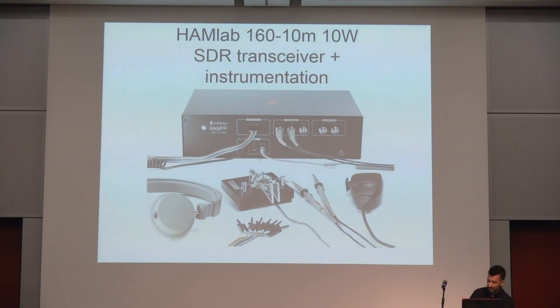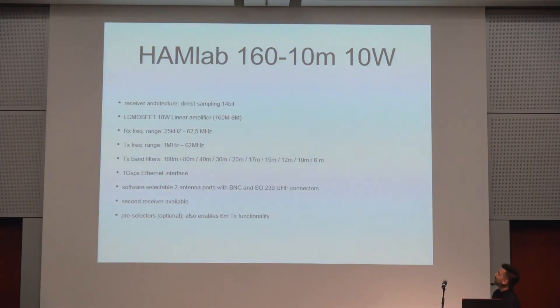Here's another picture of it. The frequency range covers all the supported bands. For six meters, the output of Red Pitaya has too much distortion — we checked whether it's caused by the output amplifier and replaced it with a transformer, but it seems to be caused by processing in the software. So six meters hardware is ready but we still need to fix things on the software side. If you use it with pre-selectors, this is already available since the output signal is sent through the pre-selectors for six meters to clean it up.